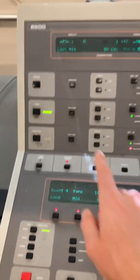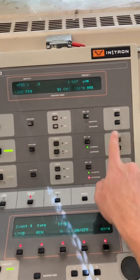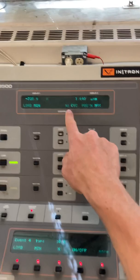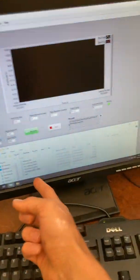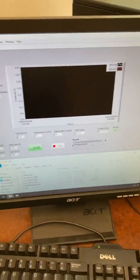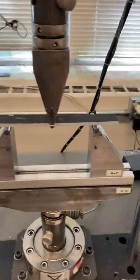Make sure amplitude control is on before you start the test — load control is on, yes, it's all good. We're tracking the cycles, saving the data. You can come over here and grab the data in the middle of the test by copying it onto your thumb drive to check if the crack has grown via the plot. Other than that, you should be good to go.